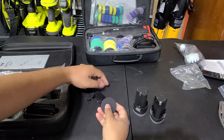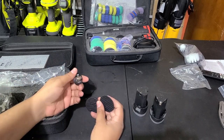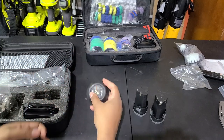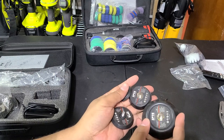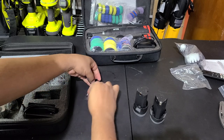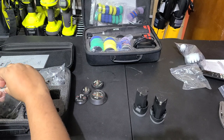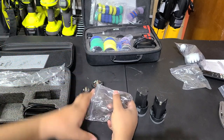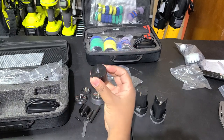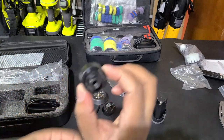We've got a three inch pad, two inch pads, and a one inch pad. The one inch pad only works with the short throw, the two inch pads work with both, and the three inch only works with the long throw. The threads are different sizes — the fatter ones indicate which throw they can be used with. We also have different counterweights: the 12mm throw counterweight and the 3mm throw counterweight.